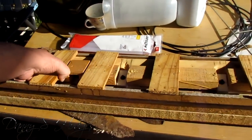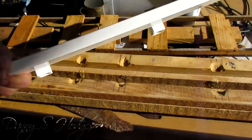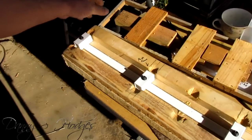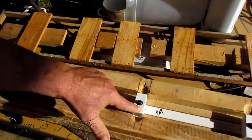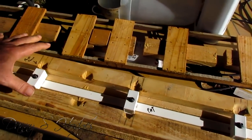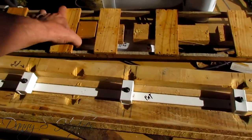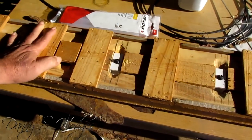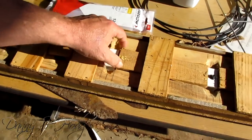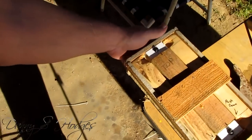You take the top off and you put your backbone piece in there and slide it all the way to the front. This is my pattern right here. You would normally put a blank piece in here without these, and then you put this on. Then you drop your little white pieces that your whiskers go on. What this does is it just makes the antenna perfect every time.